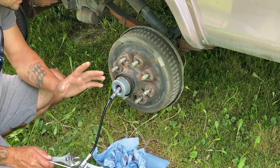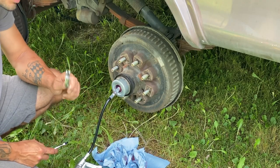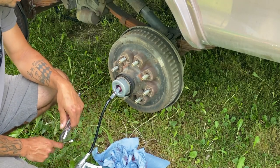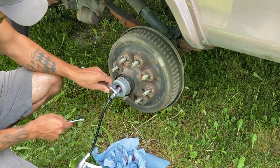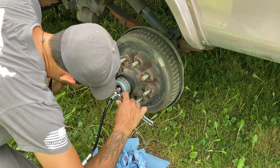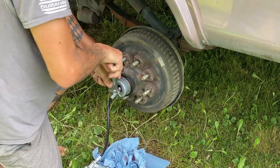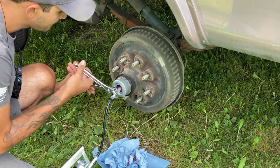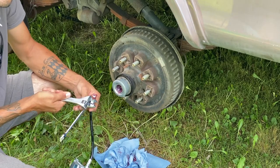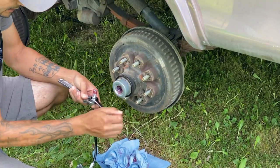Just because nothing else on YouTube ever goes as perfectly as planned when you're doing it at home — my grease gun is freaking stuck on this thing. So I went ahead and took a peek on YouTube to see a method of taking it off, and they say that if you can disconnect your fitting from your hose it will really help, because it'll relieve the pressure of the suction. So we're going to try that out right now. And there it is — that's your easiest method. If you ever get a grease gun stuck on a Zerk fitting, just loosen this nut up enough and it will relieve the pressure, and then boom — it just slid right off.